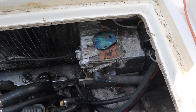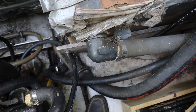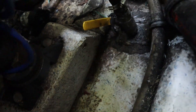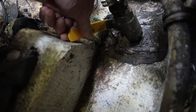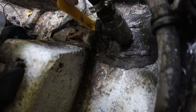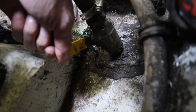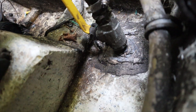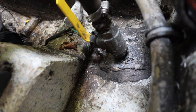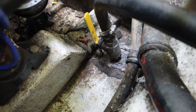So we're going to go to the back and see where the stuff goes. Back here, that's your waste tank. As you can see, mine's been stepped on a few times by people working on the engine compartment. This line at the top is where your waste comes from the head and goes into the tank. Down here is the through-hull fitting where your water comes from — this has to be open to be able to use the head, but of course you've got to be in the water. What I noticed is I can turn this with my hand, and that is super scary. Through-hull fittings for the head have sunk more boats — boats have sunk simply because of a leaking head through-hull, not because of storms or damage. So we're going to have to fix that and re-bed it.